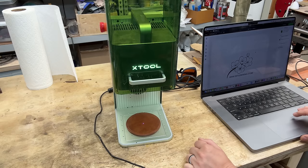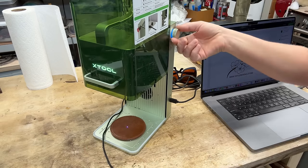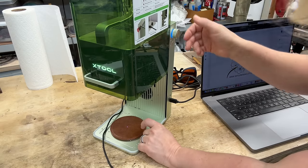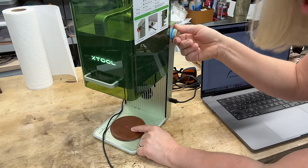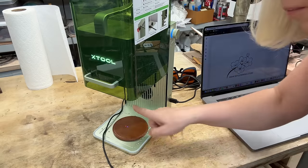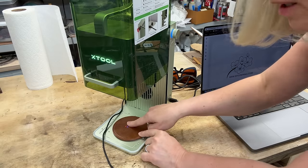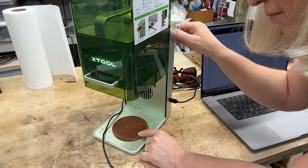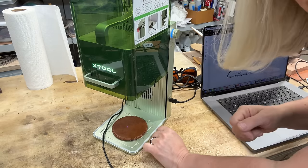I have a design over here. This button on the side — you turn it and you see those two dots. I'm going to separate them. You see the laser is going upwards right now and the dots are separating. I'm going to lower the laser until the blue and red dots go on top of each other — that means we'll be focused. This machine also has auto focus, but I feel the manual is a little more precise.